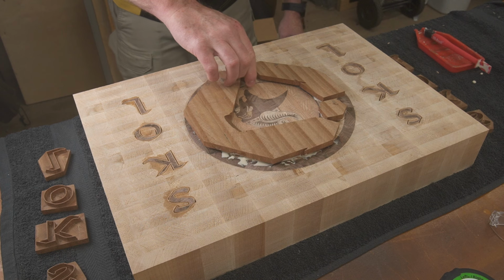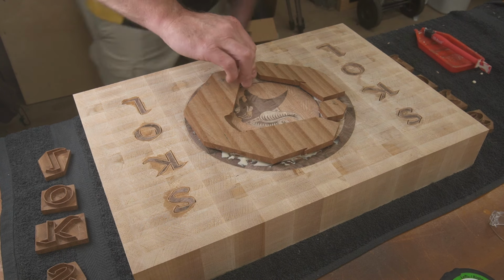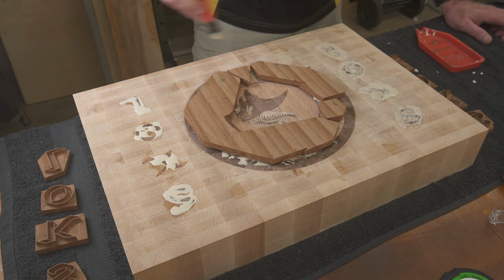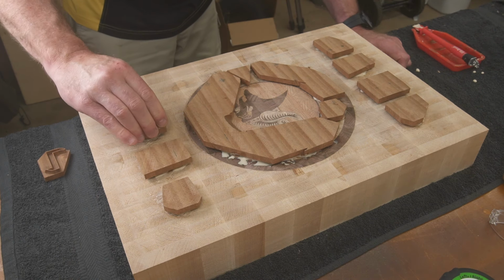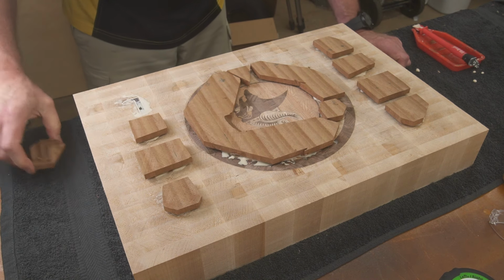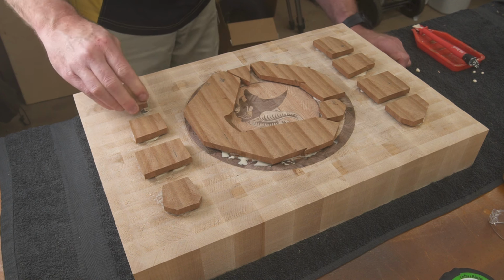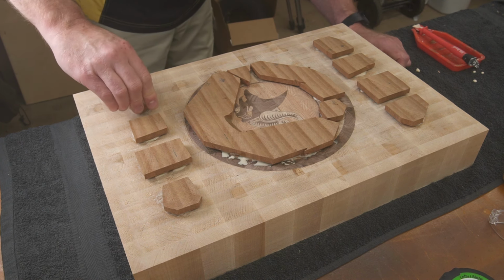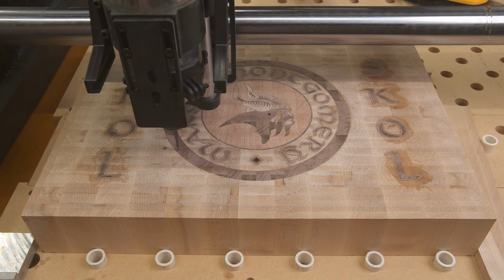When I was about halfway completed with this board, Vetric released version 12 of Vcarve and Aspire, and they included a Vcarve inlay toolpath, and I was really excited. I bought the upgrade and downloaded it, and I was very disappointed to see that it is a Vcarve inlay toolpath, but it's very limited. It only allows you to use V-bits. And like I mentioned earlier, you're not going to get deep inlays using a V-bit. So I'm a little disappointed in Vetric if you're listening.